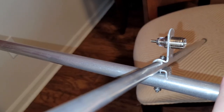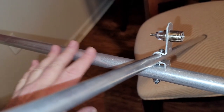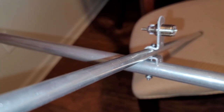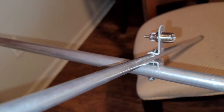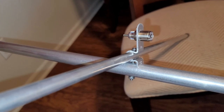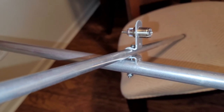This starts in hole number two in the main mast, and again this is the section that measures for this particular antenna 13 and a half inches. So you have to pay attention to the directions for these beam antennas to make sure you've got all the right dimensions in all the right spots. So we're going to put on that gamma match trombone and bring you folks right back.